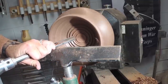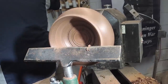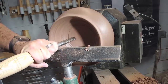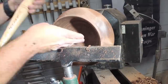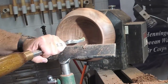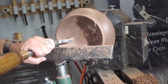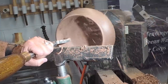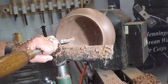As you can see, I kind of turned the headstock on the lathe to open it up a little bit and make it easier to see. I also have a bowl gouge that I sharpened into a profile for a bottom beater — I think is what they call it. That's what I was using before, and this is the Easy Wood Tool carbide hollower.